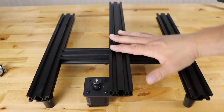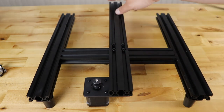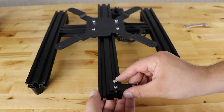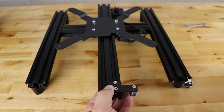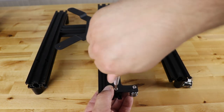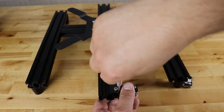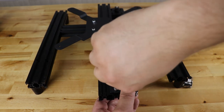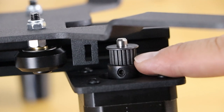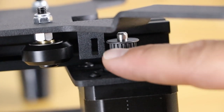So the short piece here is the rear — your motor sits here, and the long piece is on the right. On the same side as the motor we're going to install the idler pulley — it'll sit right in here and tighten through the top of the extrusion. Your T-nuts should spin and tighten it down. You don't have to go crazy tight right now because we'll tighten it up when we do the belt. Now pull the carriage back so it lines up right with the gear — it needs to be exactly lined up because that's where your belt is going to go through.